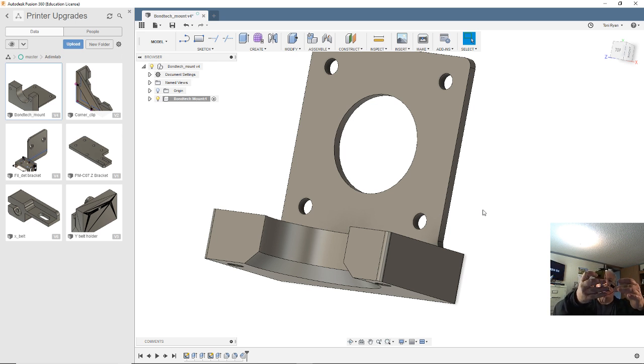So I'm just looking at the bracket or the hot end assembly with the fan. Let's say we put it at a 45, like so. We're going to have a docked system that comes down and blows an air blade right at the nozzle. Ideally, I want this to be as low as possible. But I think I only have to extend this out probably about 10 millimeters and down by 10 millimeters. So we'll do that. Draw that in here in just a minute.